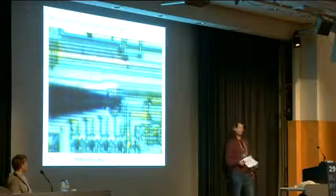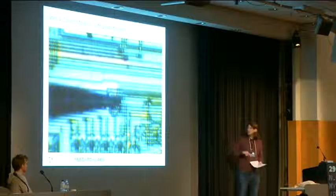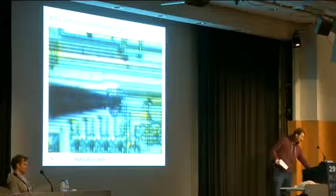And it taps this wire here. This wire coming down from here to here, and here's the tap. This is also done using scratching. I didn't use the laser here. It worked even though it was in one of the deeper layers. This was actually the only point where I could penetrate this line. On all other places, it was covered with top metal.